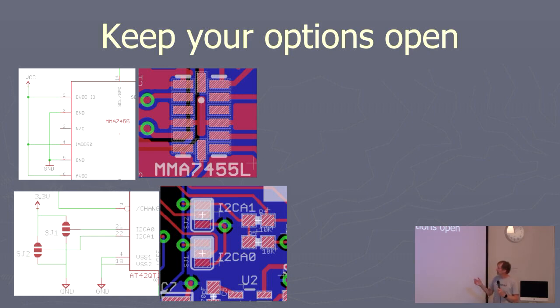So instead, run the lines out to either pull-ups, where you could take the resistor off and do an easy rework, or there are these pull-up or pull-down solder bridge things that are in one of SparkFun's libraries, which I use. It's pretty easy to swipe the solder off and swipe the solder on the other bridge. You don't have to use any blue wires at all.